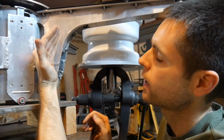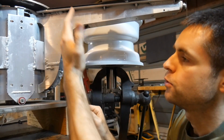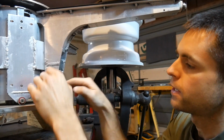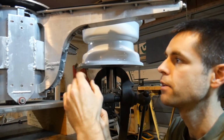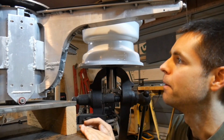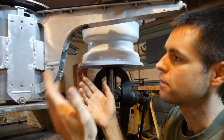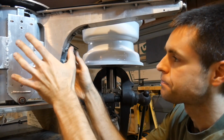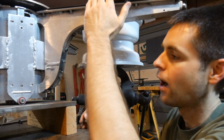I thought about having some mechanisms like this, which as they go up, do that. No dice there. You could have some sort of lever mechanism where it rides against a profile on the inside. But then there's a pivoting piece here, and then another one there. You also have to get the ratios right so that the leverage is correct. It starts to get complicated, and then you have all the play in your pins, and that stuff stacks up, and then they don't come together correctly. So what I need is a way to do this expansion motion down low and get it up high.